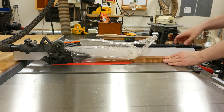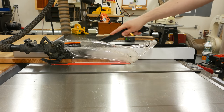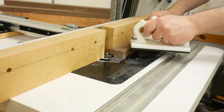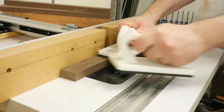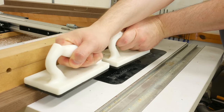Next, I cut the pieces to a width of one and a half inches at the table saw. The glass, artwork, and backer board set in a half inch rabbet that's on the edge of the frame pieces. There are several ways to cut these rabbets, but I often use a rabbiting bit at the router table, though you can also use your table saw if you prefer.